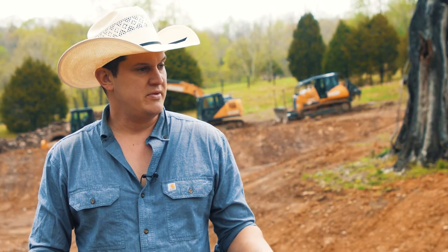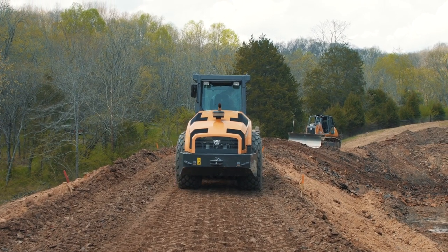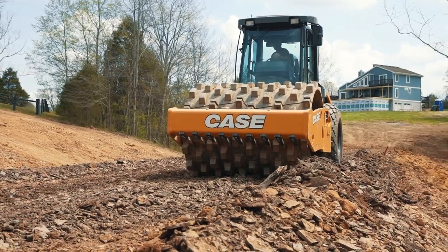We went really wide and we compacted it all, and we kept narrowing it — that's where those slopes come, the 3 to 1 and the 2 to 1, and just kept coming up. We started peeling back where we compacted and slowly just pushing up the levee. We have a lot of clay and then a lot of claystone, so we're mixing them together, and the compactor with the vibrating drum really packed it down.